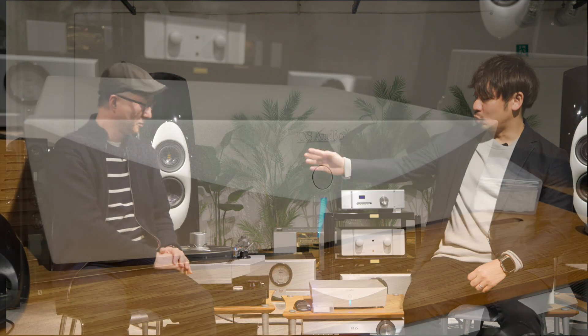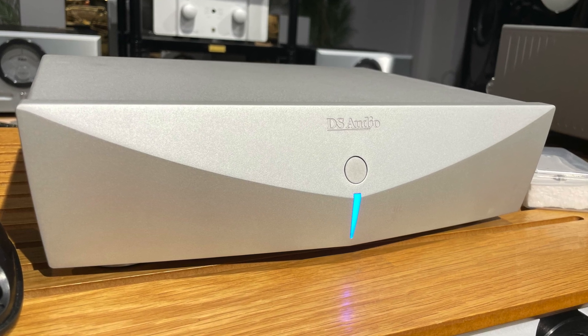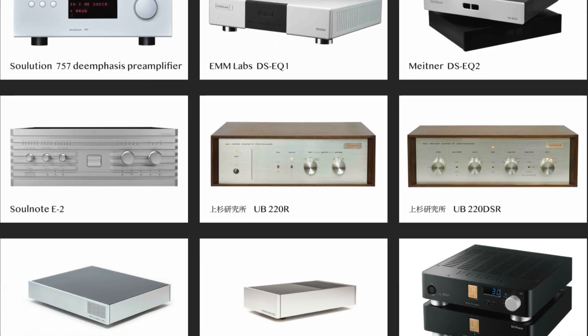As I mentioned at the start, it's a very innovative way — very interesting to hear the sound. Your cartridges modulate LED brightness via the cantilever's shading plate, so the LED needs a power supply from somewhere. The phono equalizer supplies the voltage to the cartridge. That's why we need to use our own equalizer or compatible phono equalizers — other brands can supply power for our cartridges too.